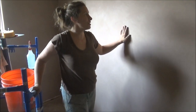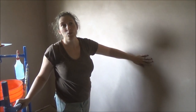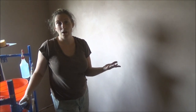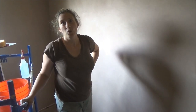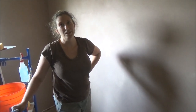Now, we wouldn't have to deal so much with it over here, but say over in Western Washington or somewhere it's wet and humid all the time, will this rehydrate itself? Well, from the air? The nice thing about clay walls is they're a living wall, so they breathe and absorb moisture from the air. If you had it in your bathroom and you take a hot steamy shower, on a painted bathroom that water will just bead up on the walls. With a clay wall, the wall will absorb that water. You won't see it, but it'll take that in and then release it. It would do the same thing in a humid environment as well. I mean, it's not going to get wet and fall off the wall.